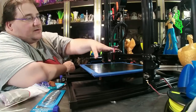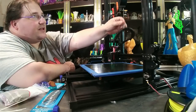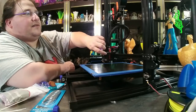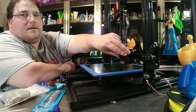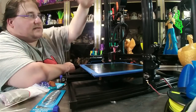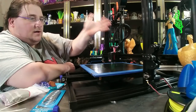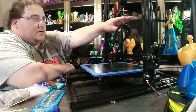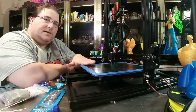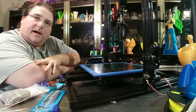That just snaps in place and that's it. As the printer sits like this, this provides just that little bit of tension — it's not going to yank anything, just enough tension to keep this loom up in the air. Now this can move back and forth freely; the wire pulls out as it needs to. As the Z-axis moves up, this will retract back into the spool, and as the Z-axis comes down, this will pull out as needed. It's strong enough to hold it up but not strong enough to apply any undue force or tension. I would hook it to the Bowden tube and the wire loom — this is the JG Aurora A5X, but they all have the Bowden tube and the loom. Wrap it around, hook it up, and you're good to go.